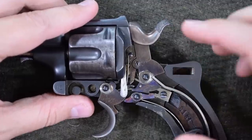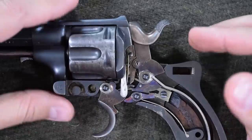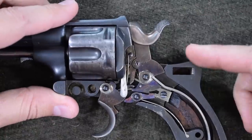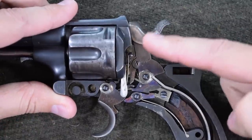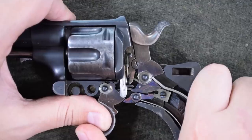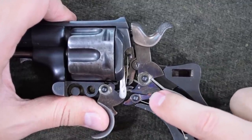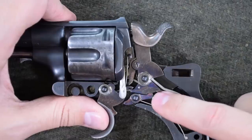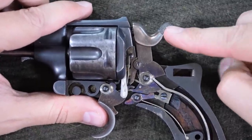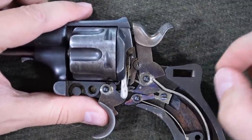However, because of the way the system is sealed, that is almost impossible to make happen without practically breaking the gun, because when this hammer is down like this, the slightest pull of the trigger, ever so slight, and it bounces it right back into a manually locked rebound. As a matter of fact, that's practically a hammer stop. You would have to blow this hard enough to deform to get past this. This is a good hammer block, right?